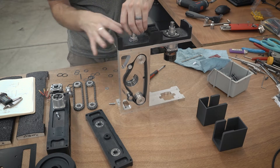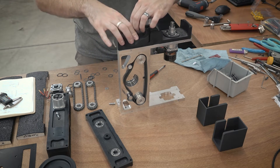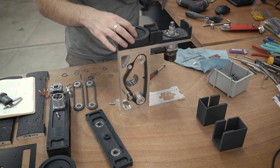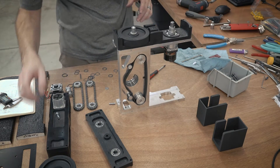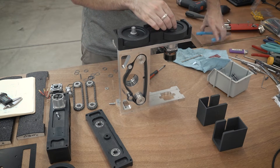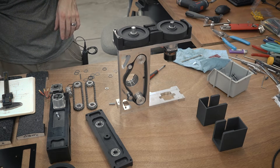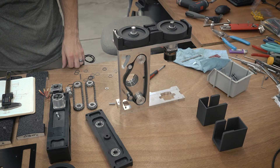You can see the sprockets on the table. I'm using chain drive — number 25 chain — to drive from the gearbox to the front axle. I'm installing the wheel and the snap ring, and then I'll install the appropriate spacers so that not only are the chains perfectly parallel with the frame, but nothing rubs against each other. What you can see now is there's almost no extra room in this drive block — the chain has a little channel at the top and can only travel through that channel.